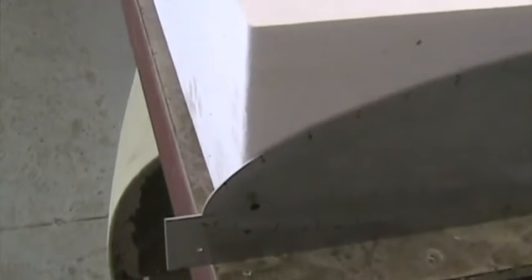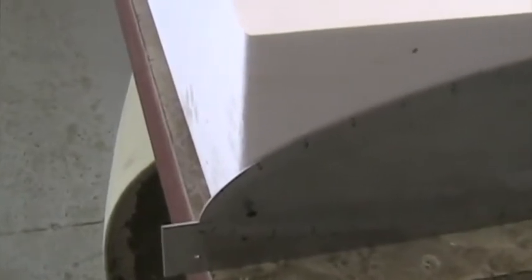Here you can see that template 1 is actually overhanging the edge of the foam slightly. Unfortunately, some foam manufacturers cannot make a block big enough for this first station on the Whisper Express. So all that will have to happen is we'll cut it as you see it there and ultimately add on a small piece on the leading edge. Most of this, however, will fall into the wing root area, which gets cut off in any case.